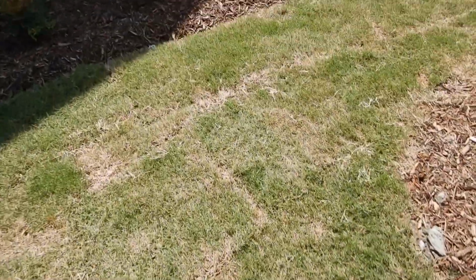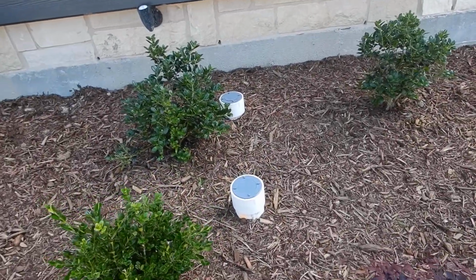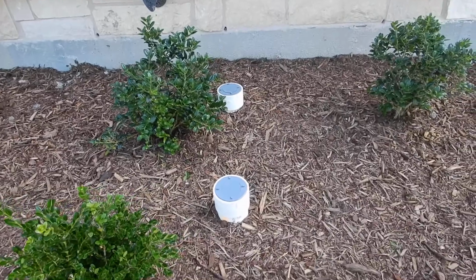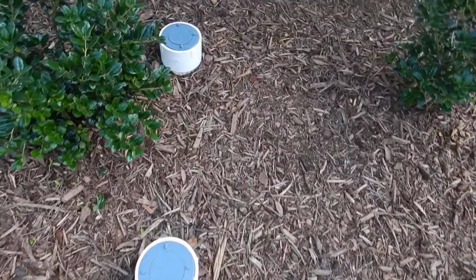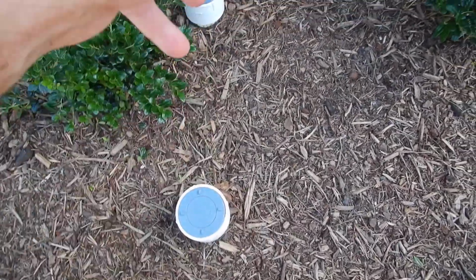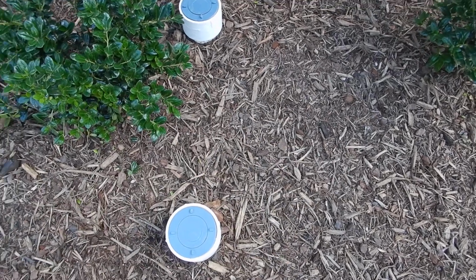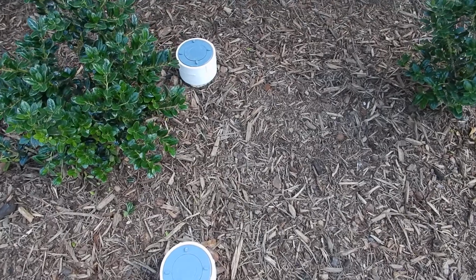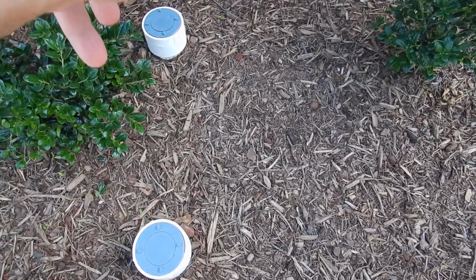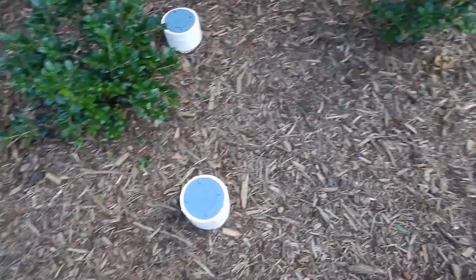These are your main cleanouts. In the flower bed, this is the west garage, the larger garage, outside the garage window and the north flower bed. These are your main sewer cleanouts. One goes that way and one goes that way, so you don't have anything missing in the middle. So if you've got a problem, then they'll bring an auger, a snake, a rotor-rooter, call it what you will. They'll slide it in there to get it cleaned out in your house, or they'll slide it in here to get cleaned out of your yard. These are your main sewer cleanouts, and that's where they're located.